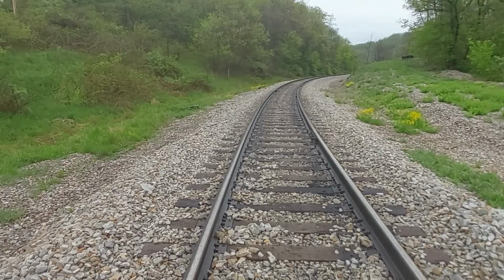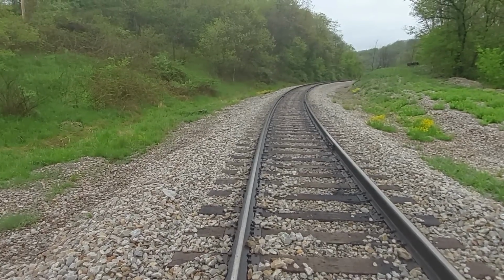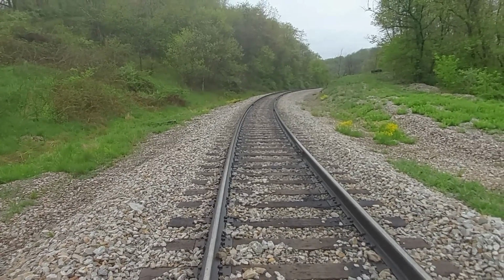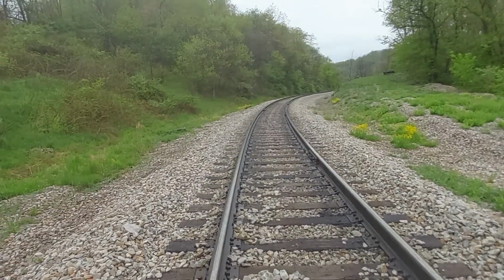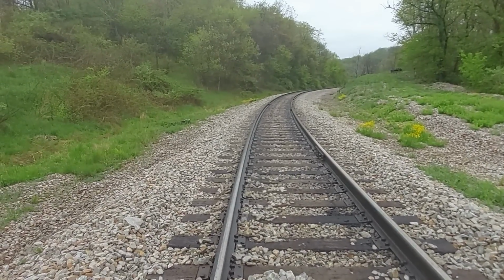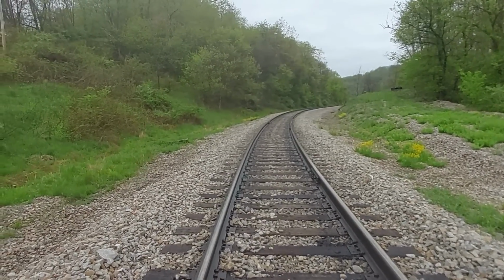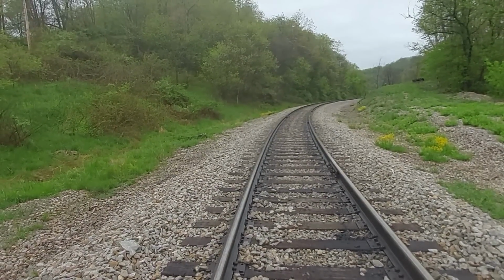Well, all right. We're here on curve 15. And I told you, actually, this is 1st of May, 2023, almost a year later since I made the first part of this video. A little bit different in climate here than the last part. But anyway, we're here at curve 15. This is a 9-degree curve. The sharpest curve that we have mainline on our track is at 13 degrees. So I told you in tangent track how your good ties are going to last 25 to 30 years.